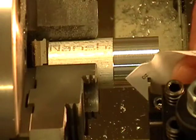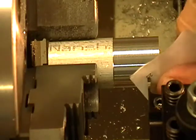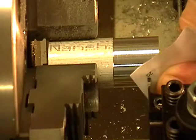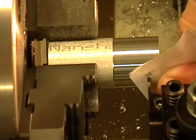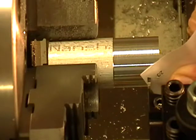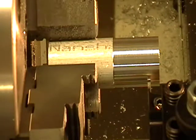Now the trick with the X is a little different. Since we're actually cutting on a radius, we have to double the amount of that thickness. So I have to say that it's point zero zero eight bigger than whatever the diameter is. That's something you've got to remember. So I'm going to measure the diameter that I'm at right now.